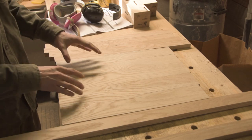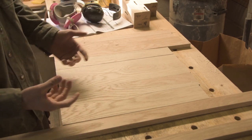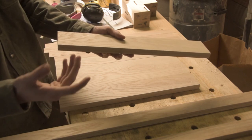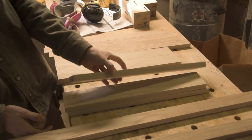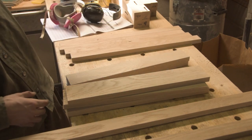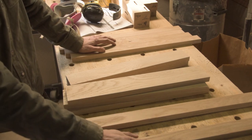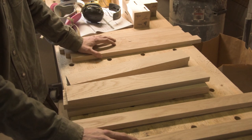On a few of these boards, I knew about the check but thought I might be able to get through it through the milling process. All this means now is you just have to replace each of these pieces. I already know the dimensions — basically all I have to do is lay this piece down on a full-size piece of white oak, trace it out, and cut it. We've got three pieces that need to be three inches, two pieces that need to be two and a half inches, and then a couple at one and five-eighths. We're going to replace the long one on a piece of five-quarter stock so I don't risk it not working again.